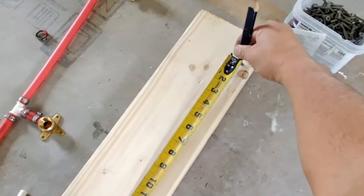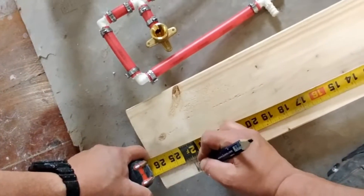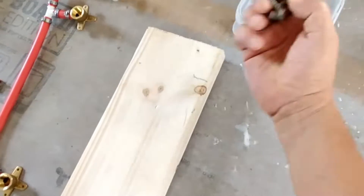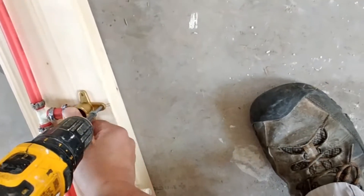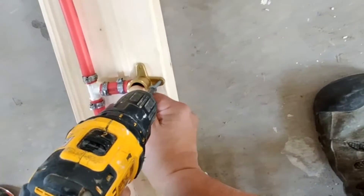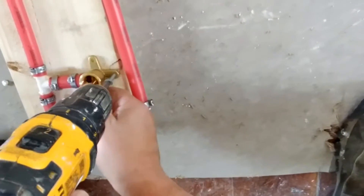This is a piece of two-by-six, so what I'm going to do is mark exactly what I want — a 24-inch space for the three jets. I'm using rust-free exterior screws, in this case concrete board screws, to fasten everything correctly. Notice I haven't cut and installed the last piece yet.